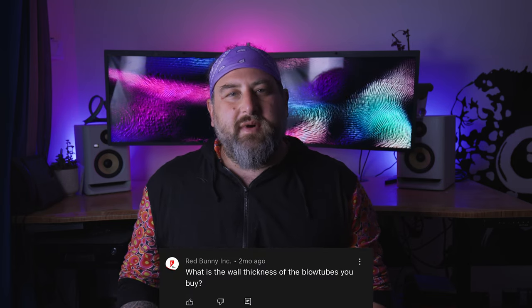Welcome back — I hope you enjoyed that vial. It was really fun working with Lazy Glass and Glass by Ginge; great chemistry in the studio. First question from Red Bunny Ink: what's the best wall thickness for blow tube? I like to use 12 by 2.2 or 12 by 2, depending on the glass — not super heavy, not thin, great weight for holding a piece without it collapsing. I also use 9mm and 16mm blow tube depending on the project.